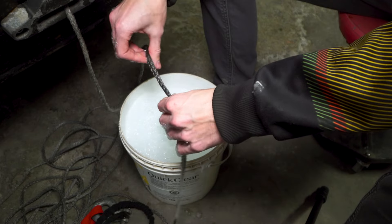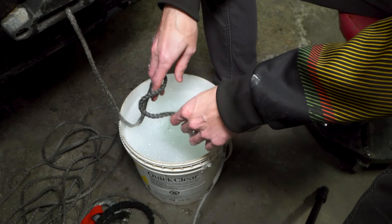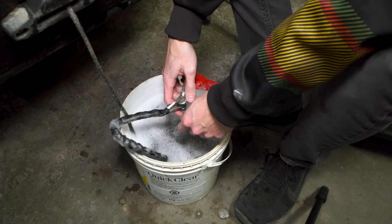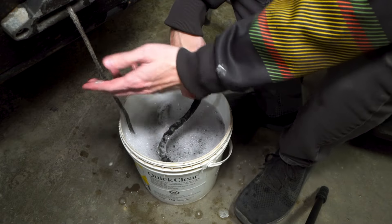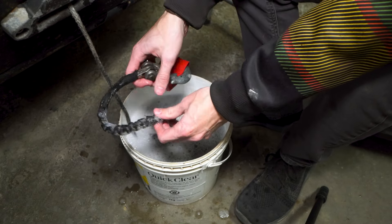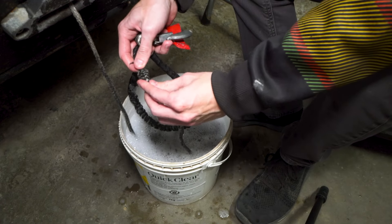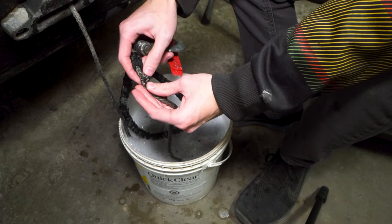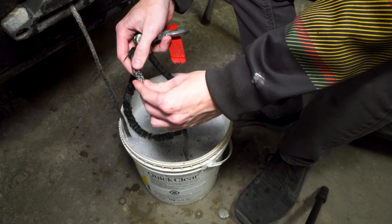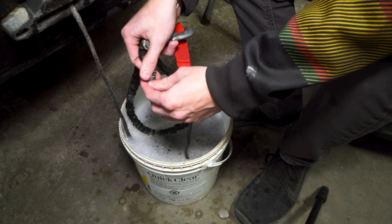This will take a few minutes — not a huge long process, but make sure you're doing it right because you never want one of these to fail when you need it most. Once your whole winch line is in the bucket, we want it to dry before winching it back in. I like to hang it on a ladder. While taking it out of the water, I'm going to be inspecting the rope — looking for frays, any breakage, especially where it has all these different braided lines. If you see breakage there, your rope's pretty much done. If one strand breaks, your capacity is greatly reduced and it will strain the other strands until it eventually breaks.